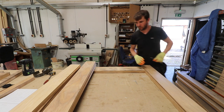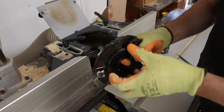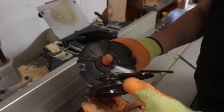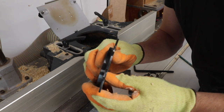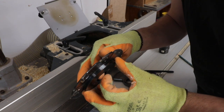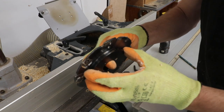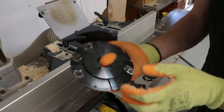We'll jump on the spindle and put the grooves in. We've got an adjustable groover here from Whitehill Tools - it's a three-part groover. It goes from 4 to 7mm, and you can see the writing here: 4 to 7 and 8 to 14mm. If you use two of the cutters - the two narrower cutters - they're offset like a very narrow rebated cutter. If you put them two together in this configuration you can do any size groove between 4 and 7mm by adding the 0.1mm shims. There are different size shims: 0.1, 0.3, 0.5, 1, and 3mm shims to make up your width. You put them in between the two cutter plates and it packs the groover apart to give you your groove width.